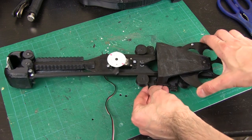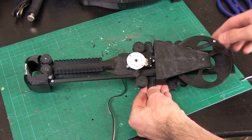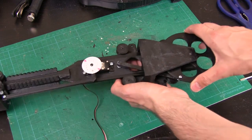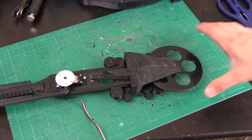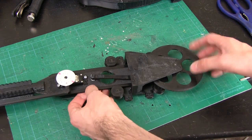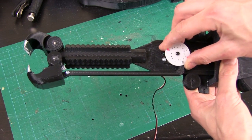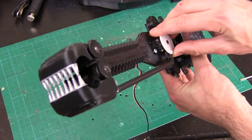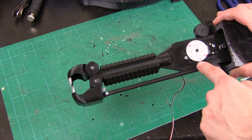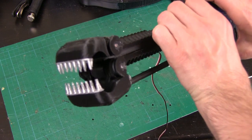Here are all the parts together — if I turn this wheel it shoves the inner jaw out. You can see the rod I've put in there which is a bit like the piston on a steam train; as the wheel turns that goes round. I'm not sure yet what's going to turn this wheel, but since the alien's head is quite long I'd like another mechanism. All of these things will be visible inside the head so I'll probably put some more decorative, alien-inspired stuff on here. Essentially the whole head is going to be a frame so you'll be able to see the mechanics inside. I've also added the rod for the inner jaw so as the servo turns it opens the jaw, which works quite well. The rod is a bit unsightly but since this is a scrap metal sculpture-inspired alien I'm not too bothered — the mechanics work and the jaw opens and closes.